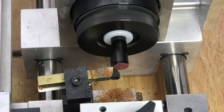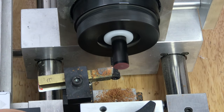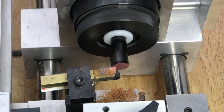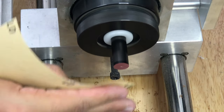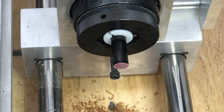All right, the pad's exposed. There's still some glue — just by feeling and by looking at it, we're going to go in one more 1/1000th. Then I'm going to touch the surface with some 150 grit. I'm going to take the tip and with the same 150 grit, scuff the bottom. It's a good fit.